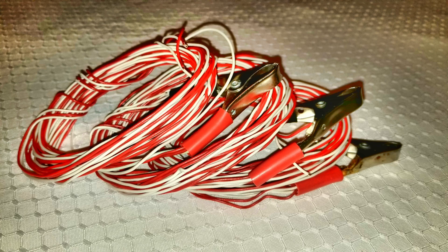I'm kind of excited to use the new ones I've made, which are dual wire but 33 feet long. So I'll have six 33-foot radials this time. Wolf River Coils does recommend more than just the three radials the antenna ships with — you can get it going okay with three, but they recommend probably six or more. So we'll be kind of comparing and working on some of that.